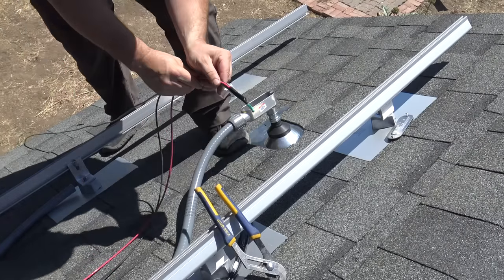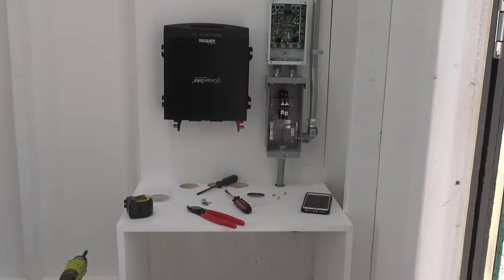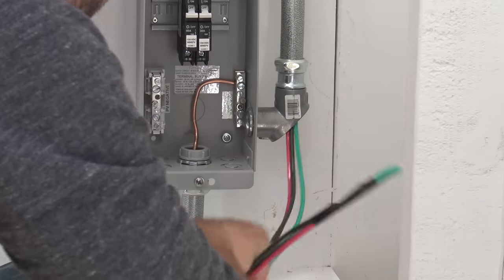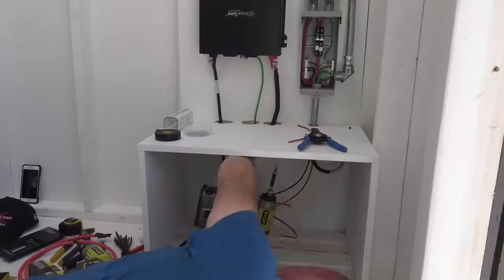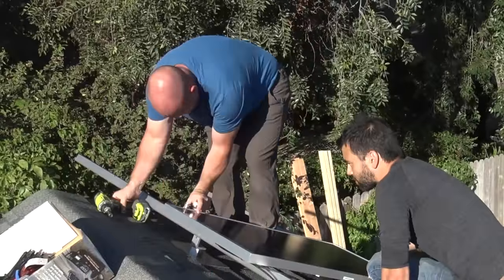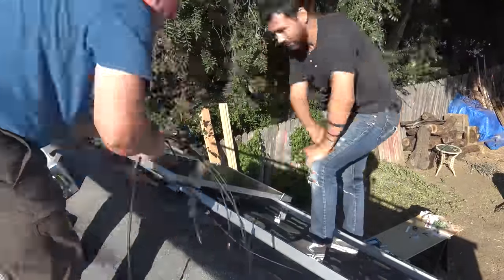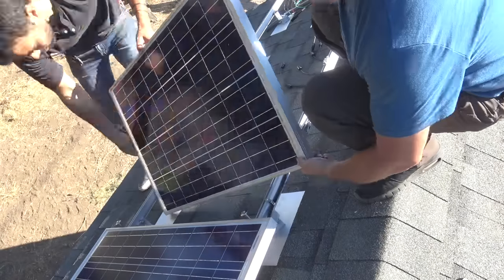If you want to learn more about installing solar electrical systems, be sure to listen to my interview with Jason on my podcast — the Modern Maker Podcast — and I'll put a link to it in the description box below. If you have any questions about this solar-powered system or any of the components in it, ask them in the comment section below and Jason has agreed to answer them. Photovoltaic panels are a solid-state technology and will last a long time. The vulnerable part of the system is the wiring, so it's really important to tuck them away so that they can't hang free and abrade against the rough asphalt shingles.